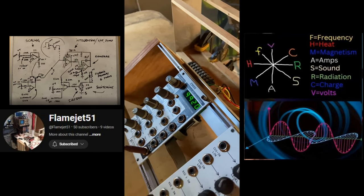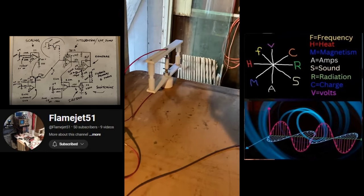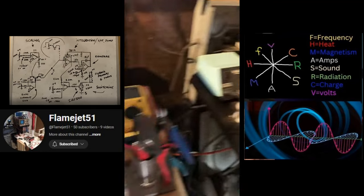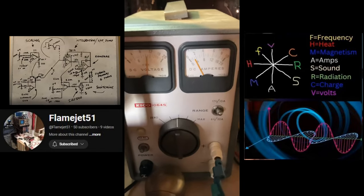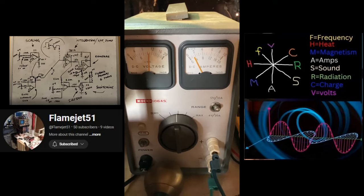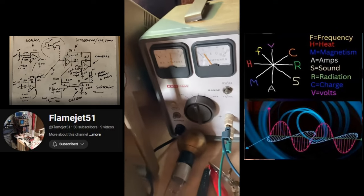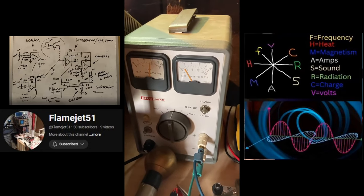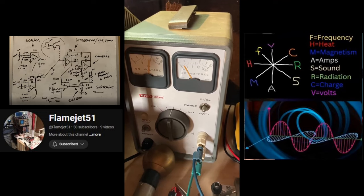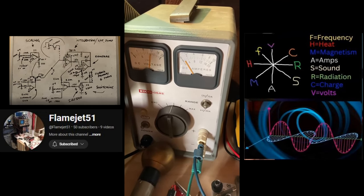You see how the frequency is changing — we have a response there. Now let's look over here. We initially dialed up to 12 volts, but you can see we're just under 4 amps of draw. So when we actually change the pulse width — check this out — see how the amps start dropping and the voltage rises.